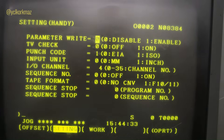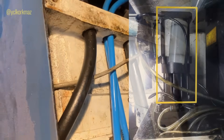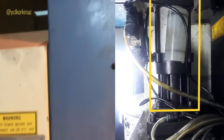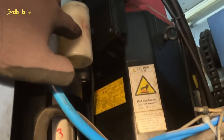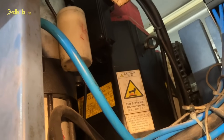If there is no alarm on the CNC screen, first of all turn the main power off. Then check here — there is a booster. The booster means it helps the unclamp piston push out. There was a sheet metal cover here — I take out the cover first, then I check if there is booster oil inside.